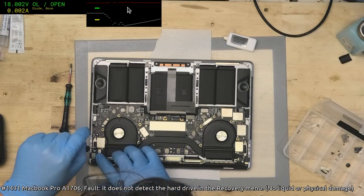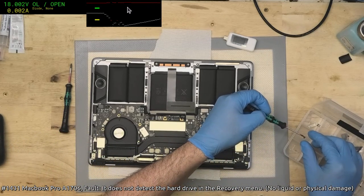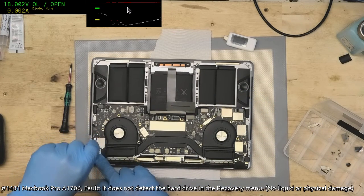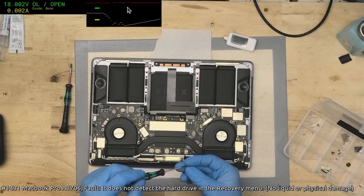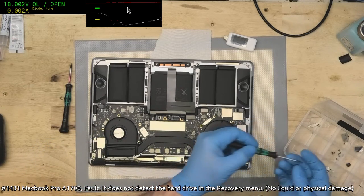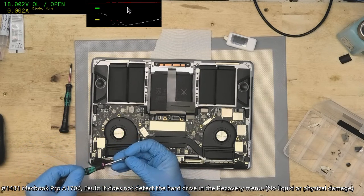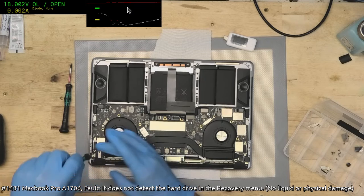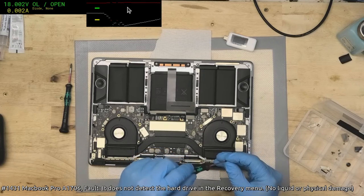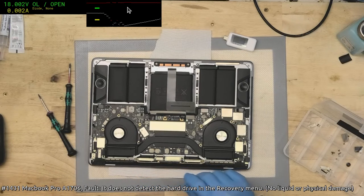Christian Alward, it was a shorted cap on the Piccolo chip, which is what most of us predicted, that it was going to be something to do with Piccolo. Thankfully it was, because when it is something with Piccolo, it's fixable. Then we also checked around the board and found that one of the caps for one of the CD3215s was only a day or two away from cracking itself and ruining the good work. So we changed that as well.